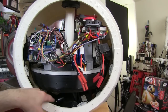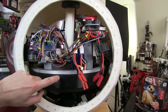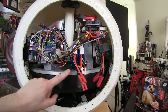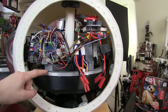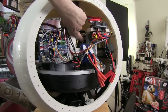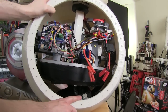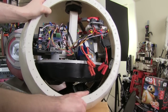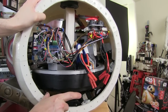The plan was either to put some more mass in pockets down here, or move down the main mass I've got already. This is the flywheel that spins to turn on the spot, and it has six kilograms of lead in it. Originally it was mounted higher than I wanted, and there's a gap of about 15mm where I've moved everything up, because as they swing sideways it hits the guide wheels in the bottom otherwise, so I'd have to make those guide wheels smaller to move this back down.